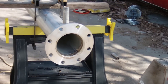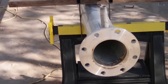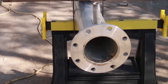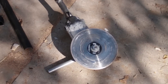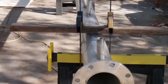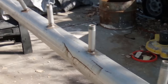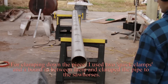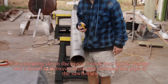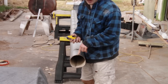On this pipe we have a bunch of attachments to take off. It's tough to cut 304 stainless — you end up running out of aluminum oxide grinding wheels. Diamond wheels work slower but for longer, so if you can find those at a garage sale you'll save some money. Then mark the top on either side, measure the circumference of the pipe, divide that in half, and half of that circumference around, make your other line.